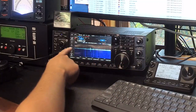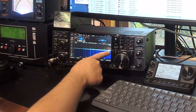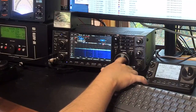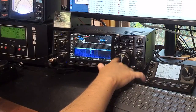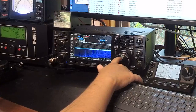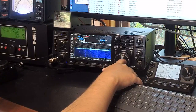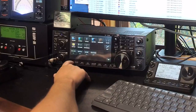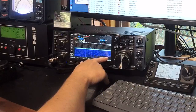There we go. You can see now up at this side we're about flat, and over here about 25 to 30 dB over. You can see the way the tracking preselector basically tracks the VFO knob, and it does its job seamlessly in the background. Now the ultimate demonstration: go into the menu, turn the preselector off — boom — you can see right there when it's been turned off.